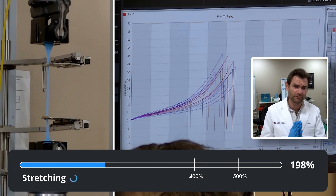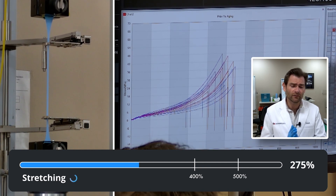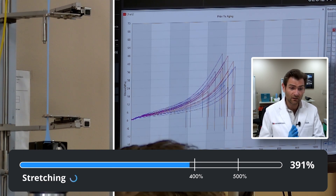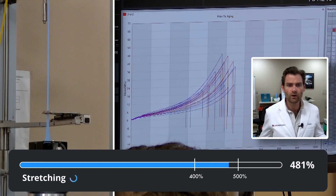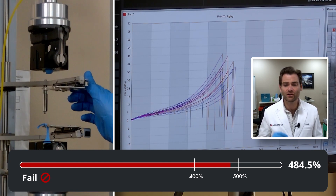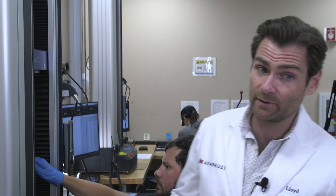It's right in the middle — it's like a chemical glove. What is a chemical glove? It's right in the center and it did make 400. 450. It broke at 484.5% — just missed that standard. Tensile strength of 34.26. It is a European standard that they're claiming. They're not claiming the ASTM or the American standard, but we're in America, so I'm going to hold them to that.